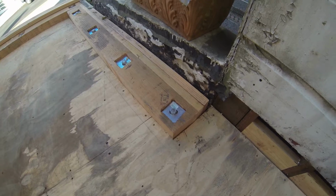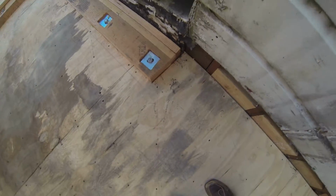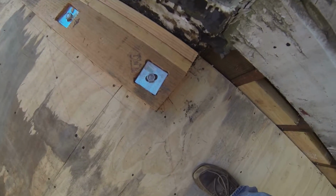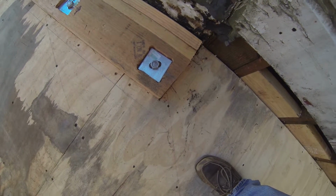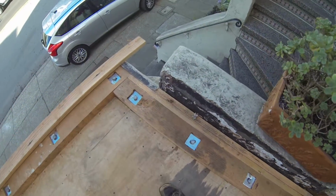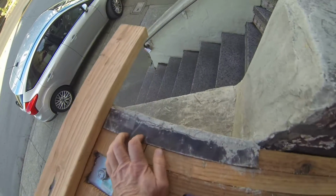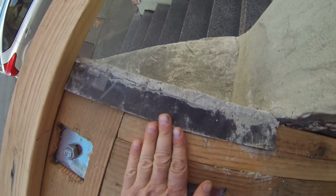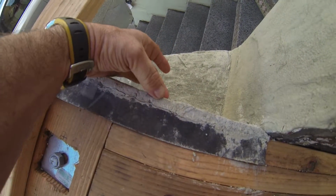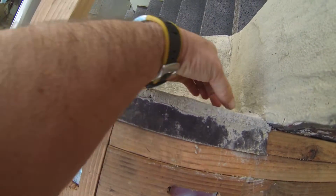This is kind of an interesting detail. You're gonna have to give some thought as to how this gets filled in. These are all bolts that need to be filled in and mudded. So you put Ardex in there so that surface ends up being completely flat. And the idea is we were gonna bring the Duradek over this stucco edge over the outside and put the L trim secured to the stucco in here.